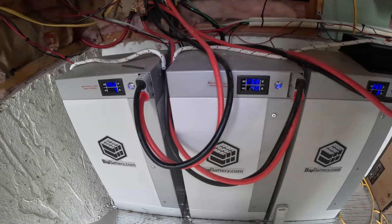In today's video, I'm going to go over the basic components of an off-grid solar power system — and I would argue that it's really just an off-grid power system. People often confuse solar power with meaning that you get some solar panels and now you have power, when in reality the main component that is most important for your off-grid power system is your batteries or your battery bank. Everything else is just there to either charge up your battery bank, draw power off your battery bank, or monitor it. Really, everything is centered on your battery bank.